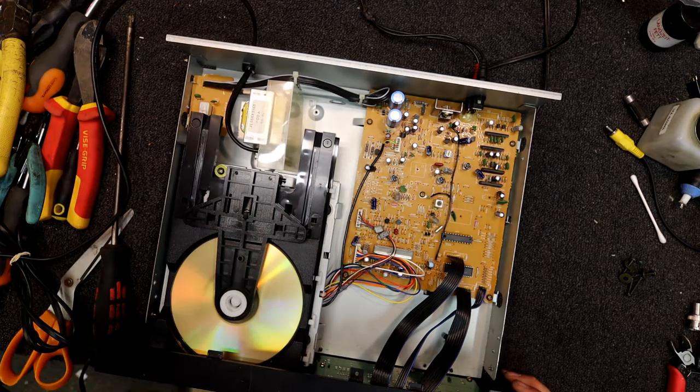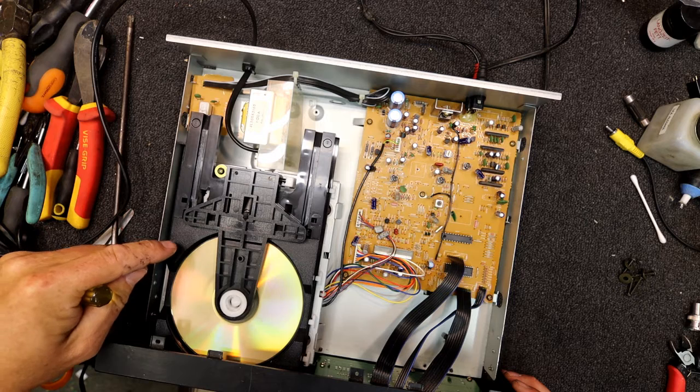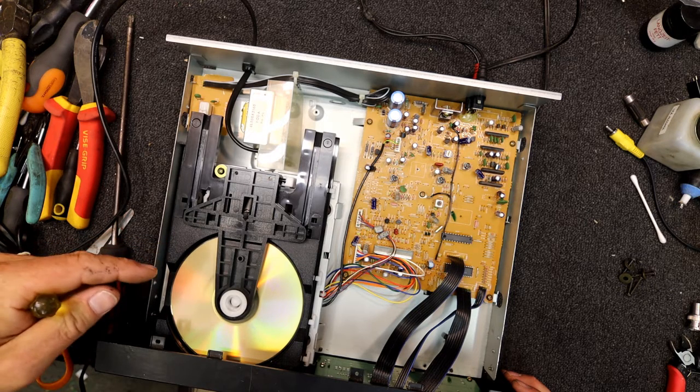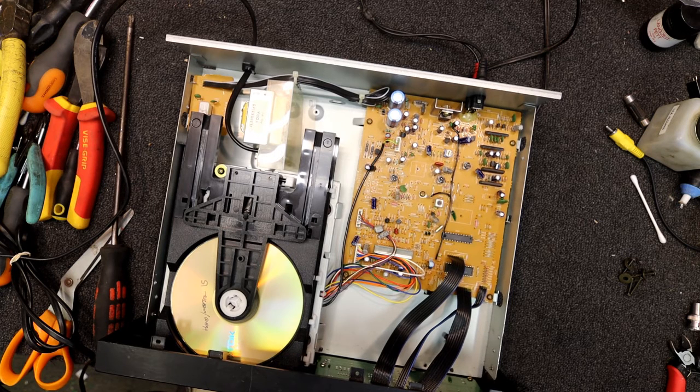And one thing I didn't try is a bit of a tap test. So it's clicking a bit. So that's how long a bad player will take to find it, if it even finds it again. No, it's given up. So that's often the case with these, they'll just give up because they can't find their position again on the disc.